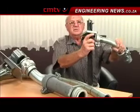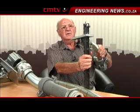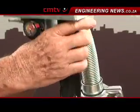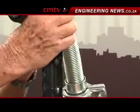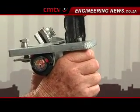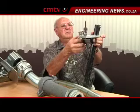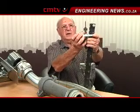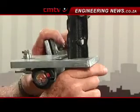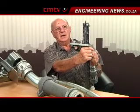The light-duty comprises a ground anchor — the black item — which gets concreted into the ground and left in overnight. The following day, we insert the anchor plate, which slides to the desired position. We attach the cable and the bracket, then the whole unit is lifted and placed over the anchor and held into the ground. That is for the normal intermediate anchor.